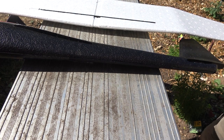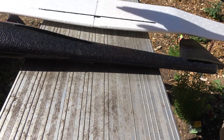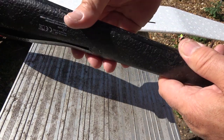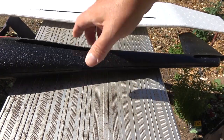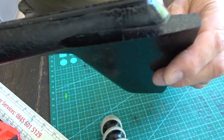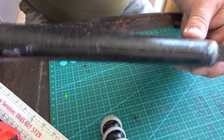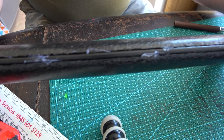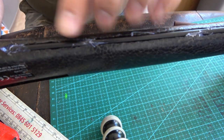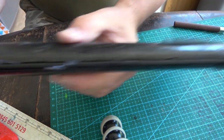This is actually happening very quickly - it's a very easy job. I'm surprised at how quick and easy it has been so far. Just get a soldering iron, melt it, fantastic. Quick update: the carbon rod for the tail has been glued, so hopefully that doesn't flex quite as much as it used to. Literally just went down with a soldering iron, put a carbon fiber rod in, made sure it's okay, then just hot glued it into position.